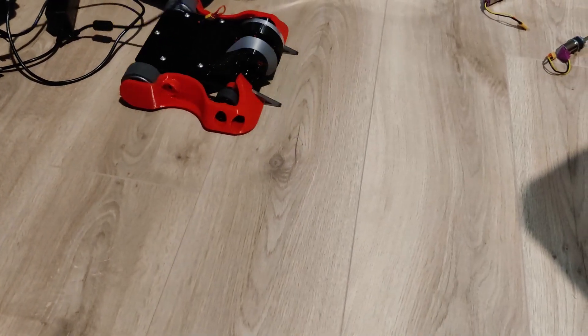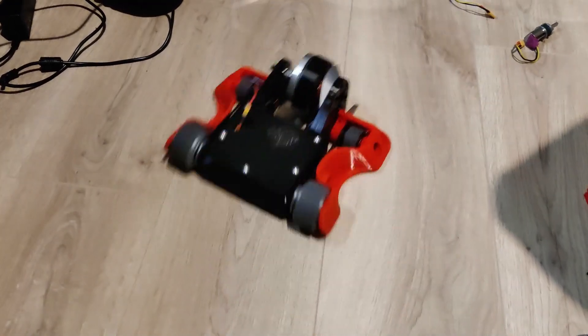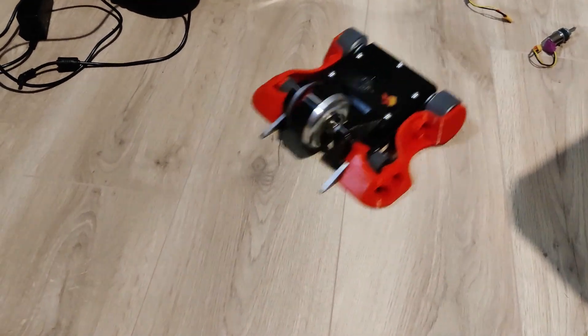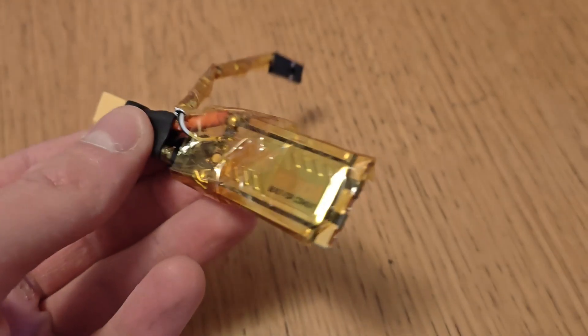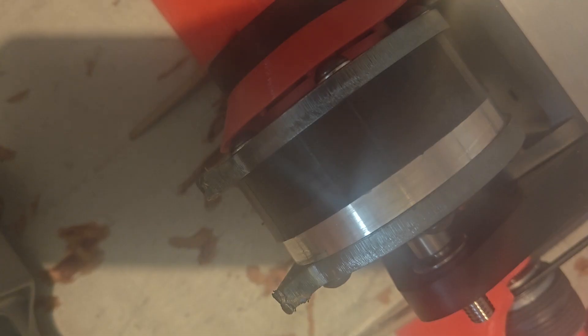Okay, so we're back — everything's assembled after a little bit of technical difficulty, and the only thing I haven't done is put in the actual weapon. This is a dummy so it has the motor but no blades attached — I did this as a safety precaution during initial testing, and it turns out it was a really good idea because we have a failsafe issue. Whenever I turn the robot or put the drive to full, the weapon spins up slightly, which is not safe. I tried pretty much everything — capacitors on all the motors, shielding all the signal wires, physically moving the ESCs away from the noisy drive motors — and absolutely none of it worked. I ended up replacing the nice 70 amp Pariah ESC with a random no-brand ESC I'd purchased for a different project. Not ideal, but that solved the failsafe issue.